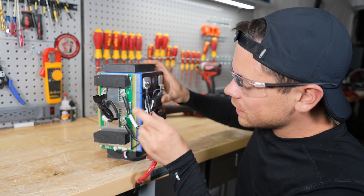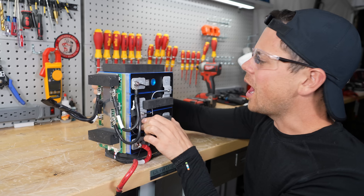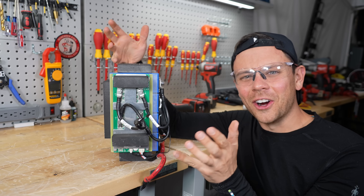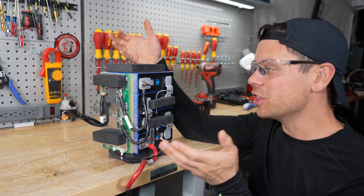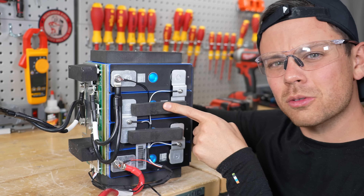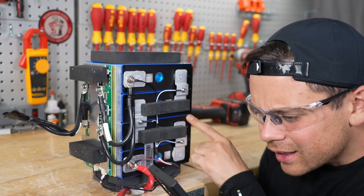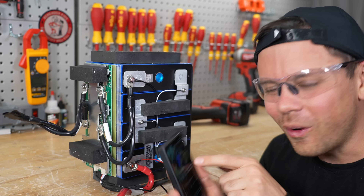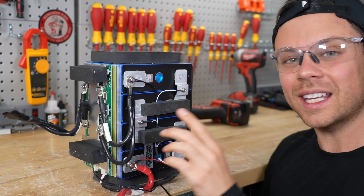Here's the temperature sensor — it worked on the last one with this same BMS. Who thought 700 amps is a good idea? I was excited about it in the last video, but now that I'm really thinking about it, it's just not safe. That is a lot of current. Build quality is decent, but not that good compared to the competition. The WattCycle has metal cell holders; this just has foam and tape. Also, the overpressure relief valves are covered with foam — one of them is covered on this one, and there are two. I don't like that inconsistency.